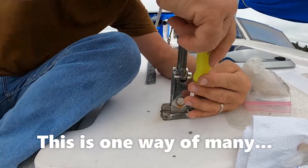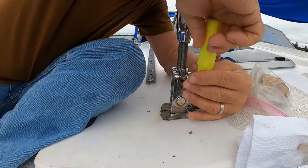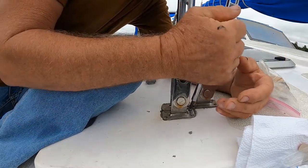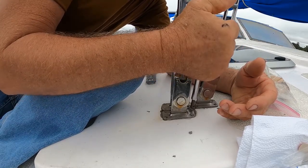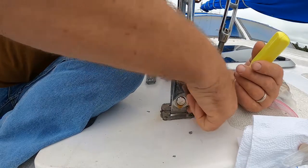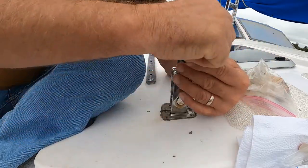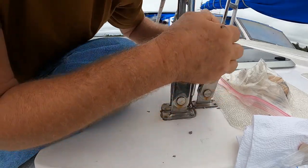I kind of wanted to go over what I'm doing. These things move so much from the tension from sailing and rocking of the boat. I did this when I first bought the boat and I've used butyl tape to seal around these chain plates. But it's obviously gotten where it leaks again and I'm just going to redo it. I think it's been three years, which is a pretty good run, so I'm alright with doing it once every three years.